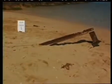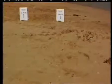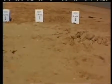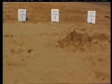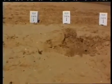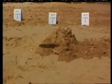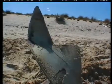The 60 kilogram DMS 55 starts to penetrate quickly, and after 1 metre, the holding power has reached 1,060 kilograms. The anchor does not appear stable during burial. The load continues to increase until after 2 metres, it has reached 1,670 kilograms. The load then starts to decrease dramatically, and by the 3 metre mark, the anchor is rolling out. The anchor continues to drag at a load of 800 kilos. The soil is considerably disturbed. Penetration varies as the anchor changes attitude during dragging, resulting in one of the fluke extremities being damaged under load.